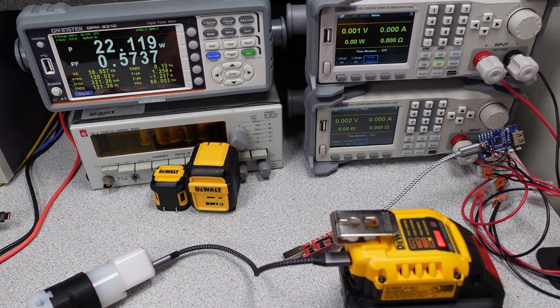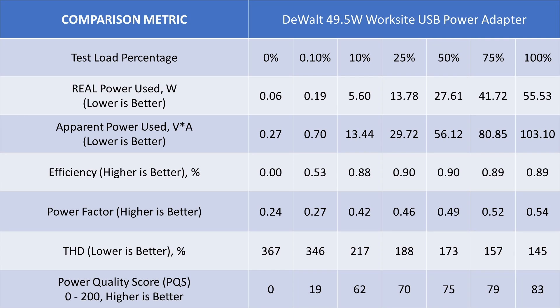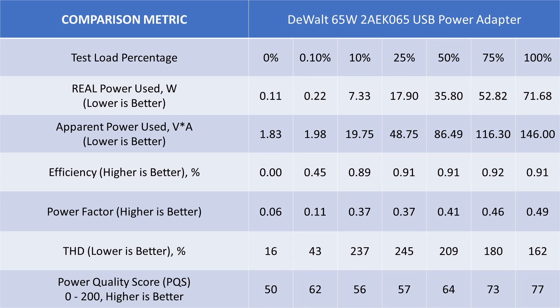Looking at the data: the 12.5 watt power adapter isn't anything impressive. It is fairly high on AC harmonic distortion, the power factor is low, and it really isn't doing anything special. It does deliver the rated power on the DC side and works as a power adapter. The 49.5 watt continues this trend — the power numbers just aren't very impressive. This is a chart topper and loser on its own since there aren't other 49.5 watt adapters to compare. The 65 watt adapter continues the trend even from a different manufacturer — it's just not going after an efficient or clean power supply design. It functions, but is very low by comparison.